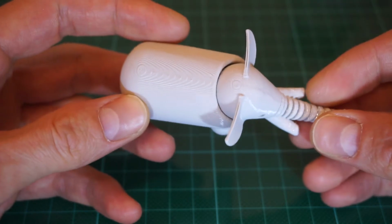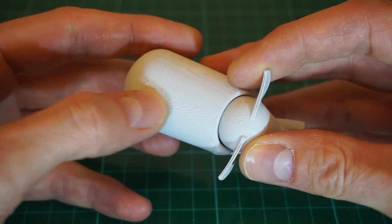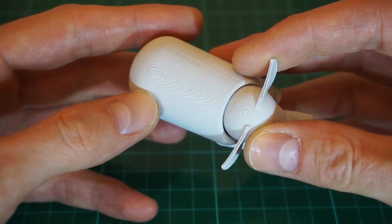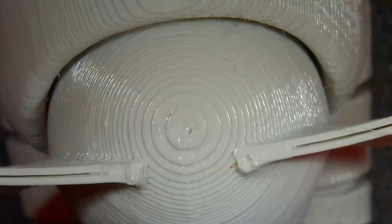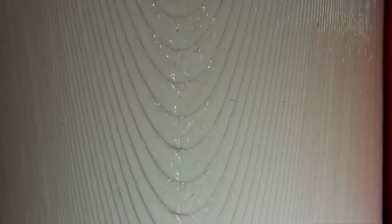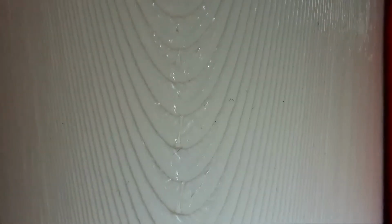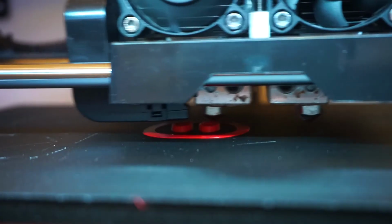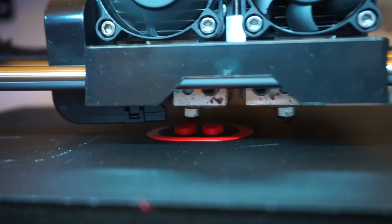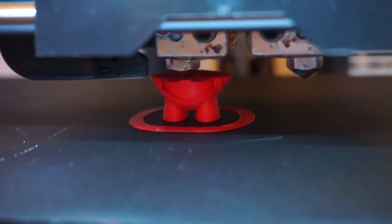In 3D printed models, vertical surfaces look fine for most purposes, even at coarser layer heights of 200 or 300 microns. However, slanted surfaces show a stepped pattern, which becomes more or less pronounced depending on the angle of the surface. The worst looking areas of a 3D printed part are typically where the surface is close to horizontal. If you want to print a part where you consider this to be an issue, and don't want to resort to post-processing, there's usually only one option: print the entire part in a higher resolution. This, however, dramatically increases print time to the point where even small parts can take several hours to print.